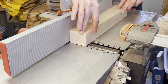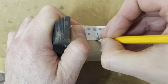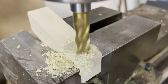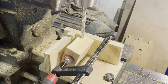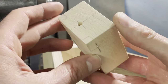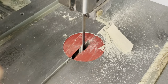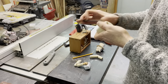Once the designs were complete, I started with making the sculpture. Its geometry was pretty much the same as the original, which I took sizes and dimensions from, and then I cut the individual parts to a basic block form. Before I carved the sculpture, I drilled all the appropriate holes for the shafts and fixings. In the past I've done this in the opposite way and it became difficult to clamp the carved pieces and then drill to the required dimensions.